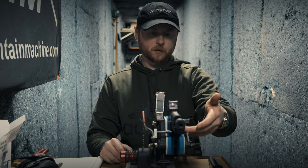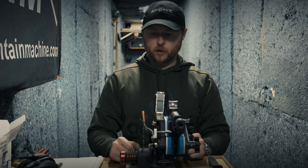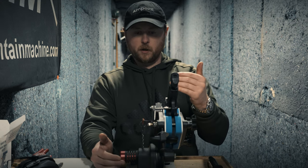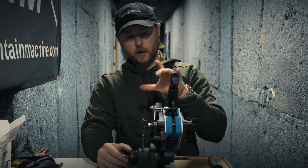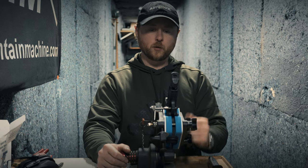You're able to clamp the guns in with specific pads here that are molded to the gun, get a consistent sight picture, as well as a consistent pressure on the spring here. So when the gun fires, it'll recoil, it'll pause at the last part of recoil, and that's where we went and bolted a digital inclinometer to it. So we're then able to record that angle that it has risen to.